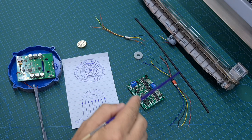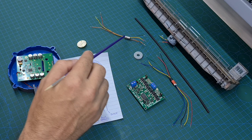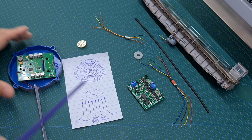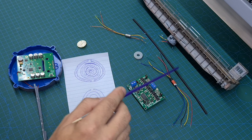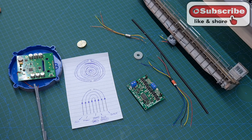I've already taken care of the color coding. The wiring items I'm using in the new solution don't have the exact same wire colors as the original, so I've made sure to get everything properly aligned and not cross any wires, because that could be bad. I'm going to go off and come back with these wires attached. I've also got heat shrink that I'll use over each of those wires to make sure there's no crosstalk or short circuits.